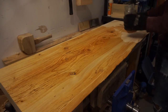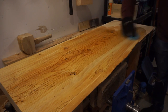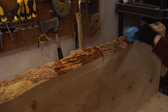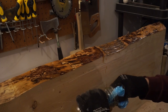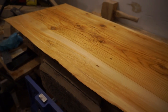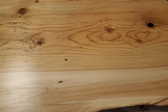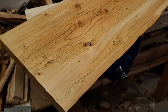You can see some of the interesting patterns in the wood and the different figure that was in some places. I finished off the live edge as well with the wipe-on polyurethane - basically just wait for it to dry, add another coat, wait for it to dry, add another coat, and after a while you end up with the final product. Overall I'm pretty happy with how this turned out. This is hopefully going to be the top of a coffee bar, so keep tuned to the channel to see the progress there. Thanks for watching the video, hope you enjoyed it - until next time, take care.